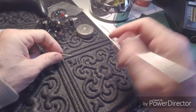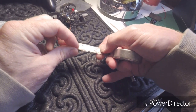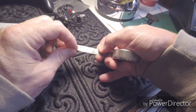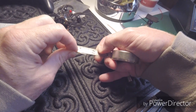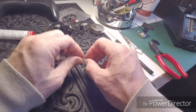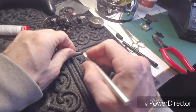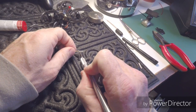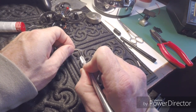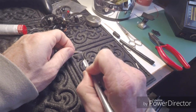The next thing you're going to want to do is measure the radiator. Now this one's going to be too short — 5.6 to 5.8 GHz is exactly a half inch. So this one's going to be too short; this is for higher up in the band. But the main thing is you want to see where you're operating in the band, then trim this radiator with a pair of tweezers, cut it off to be exactly just down to where the shield starts. That's your active element — where the shield stops, this is your active element radiating right here.